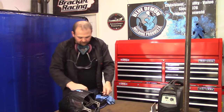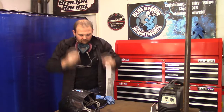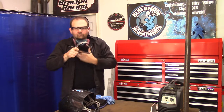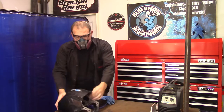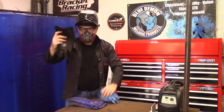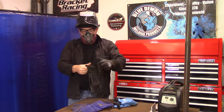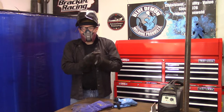You should always wear the proper clothing and safety gear while welding. This includes, but is certainly not limited to, a welding hood, welding jacket, or long sleeve shirt — I would suggest cotton or wool as synthetic materials may melt to your skin. Next, select the proper thickness of gloves, ear protection, and safety glasses. One should always wear eye protection during the welding process. Here's a tip: many welders will wear a small respirator like the one seen here. It filters out some of the harmful things floating in the air, and it also directs the hot air you breathe down and out of your hood, preventing your lens from fogging up.